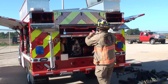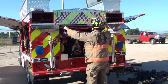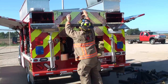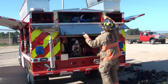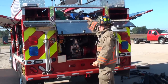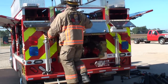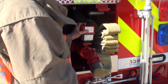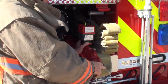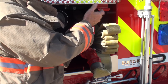Here's our hose reel, if you ordered that. The recessed directional light bar, the wind for the hose reel, the third brake light. This is access to our rear hose bed storage. A pre-connected blitz monitor if you order that, and here's your pull-out step. On the back, I want to point out the autofill. You turn it on automatic, hook it up to your hydrant, open your hydrant, and the hydrant will fill this tank up to 90% to 95% and shut it off.